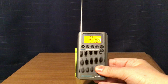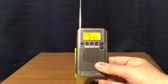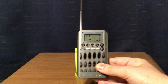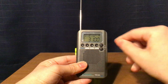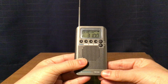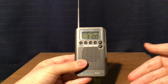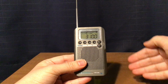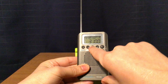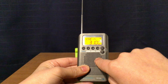the VHF wideband is mainly used for broadcasting, whether it's FM or analog TV sound for countries that still have it, or campus radio. It covers 30 to 230 megahertz, so that's what wide is used for. Narrow is used for more scanner-like functions like police, fire, marine, military, or weather band activity, including 2-meter ham as well, and I think even 6-meter. That's where narrow is, and I get it by pressing the mode button. You can change from VHFN to VHFW, from narrow to wide.